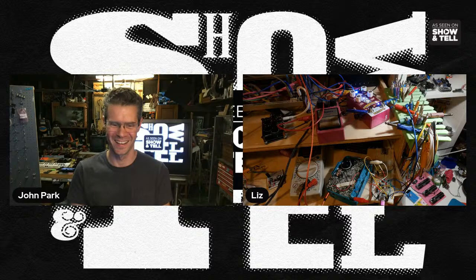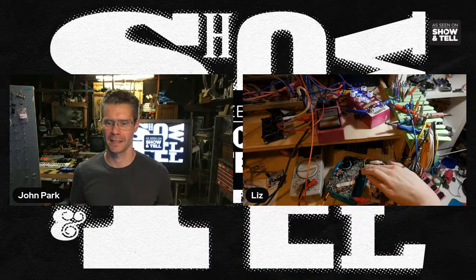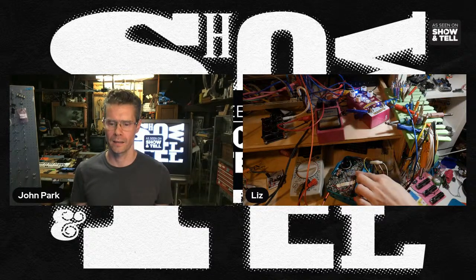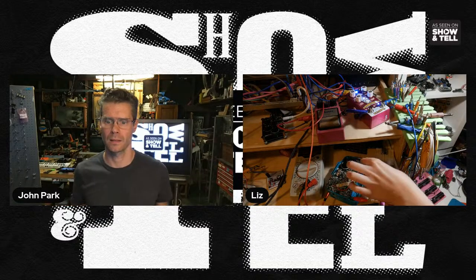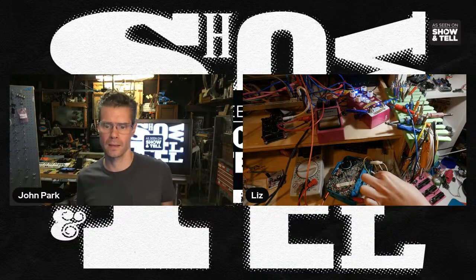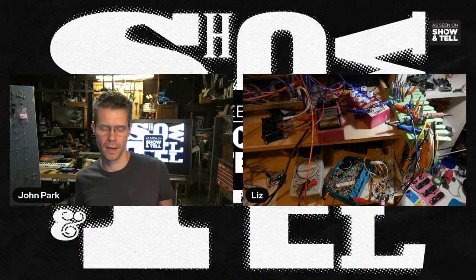That's great. And what's good is it's really easy to desolder those wires. It was just 2 points, and they weren't through holes, so I just had to heat up the point and then was able to pull them out, and then I gave them extra length. Extra great. Yeah. And it's super available too. These are 15, 20 bucks on any online retailer. That's kind of the one Walkman style player that exists right now in the world, manufactured new.